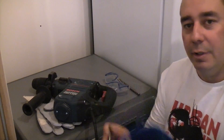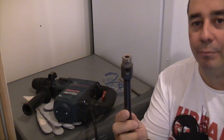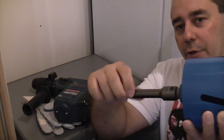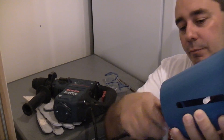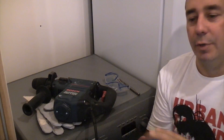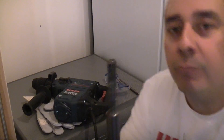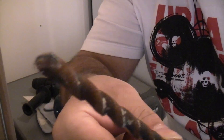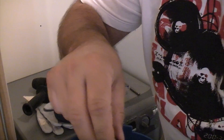In order to use the core drill you're going to need an arbor, and this screws into the back of the core drill. There are generally two types available: there's a standard one that goes in a standard chuck, or there is this type which is for an SDS drill. When you've screwed the arbor into the back of the core drill you then need to insert the pilot drill, which just drops into the middle and that's a taper fitting.